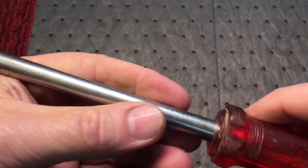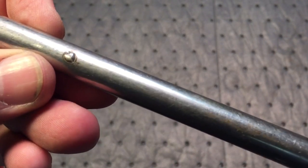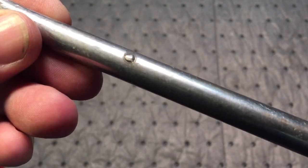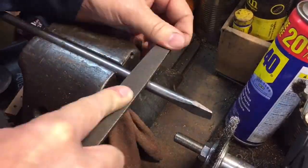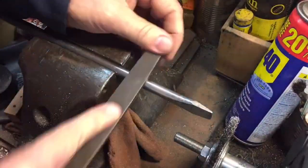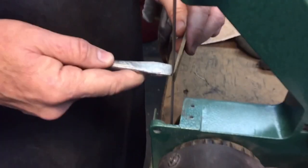I got this nice and smooth. I don't know what was on it, except I got one little bump here — you see, that's a weld splatter. I'm going to try and file that off. I know this sounds crazy, but one of the most wonderful things you could do is to file a round surface with a flat file. It doesn't seem like it works, but it works fantastic.